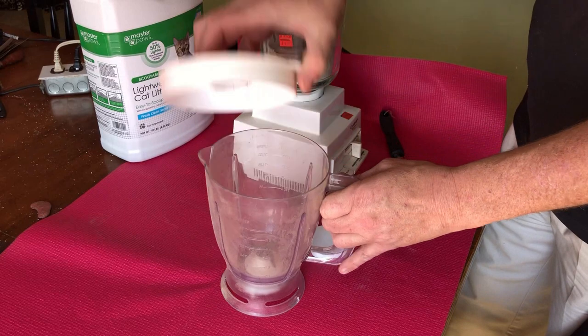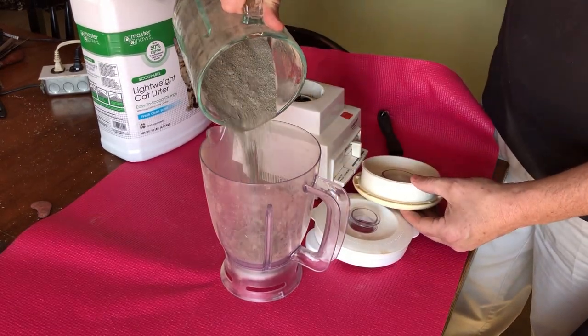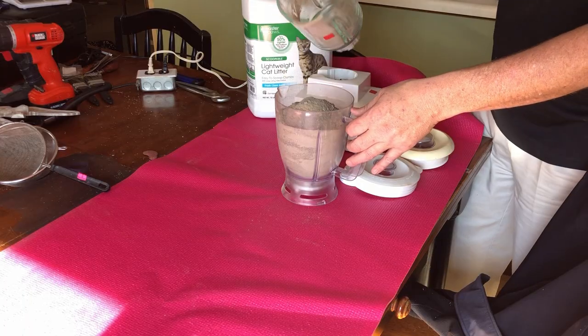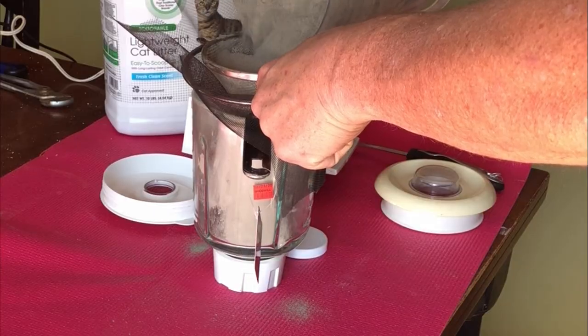Okay, so in a nutshell, we had two major problems. One, too much moisture in the sand. I went back and watched some other videos and realized that I mixed way too much water, and then I learned how to mix the correct amount, which I'll show you here in a minute.